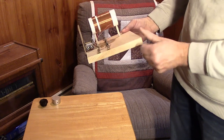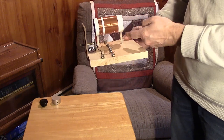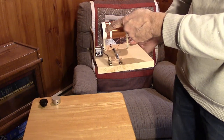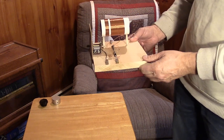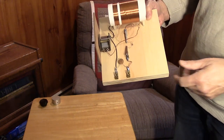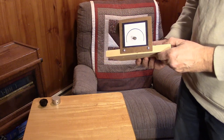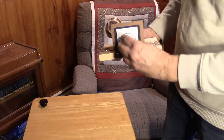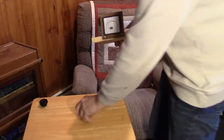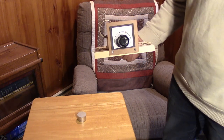Here are the taps on the coil. Right now I'm on the maximum inductance point to the capacitor, and I have the diode tapped down closer to the middle of the coil. I'm using the entire primary, with a tap in the middle to cut that in half as well. You guys may be wondering why your crystal sets don't work. If you were a crystal set, would you work with a knob like this? No — that crystal set wants to have something on it that looks a little sexier than that. Now that set will work.